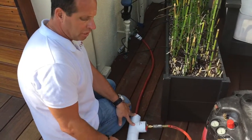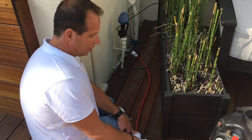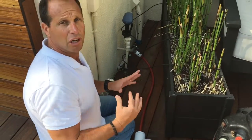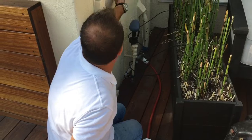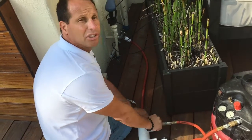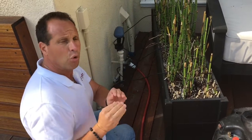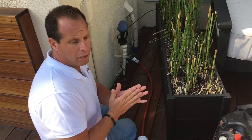Now that we've heard what we heard through the metallic line inside the house using our probe, I like to back ourselves up. We take our pressure rig with no water — we shut everything down from the street so we just have a static line in the pipe — and hook up a pancake compressor. We have a valve that controls it, and instead of being invasive and cutting pipes, we try to get to a spigot nearest where we're hearing the leak. This spigot comes through the kitchen, and as we inject air we're going to introduce the sound from underneath the island. We do short pulses of air; it mixes with the water and it's a totally different sound — more of a boil sound than a metal pipe leak sound.